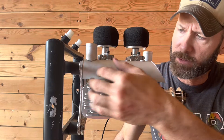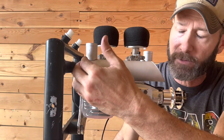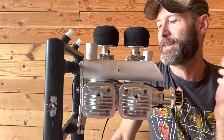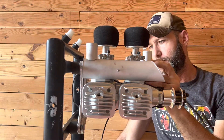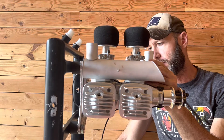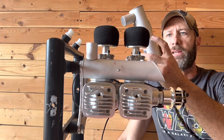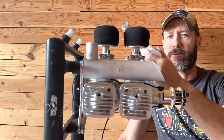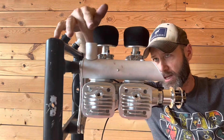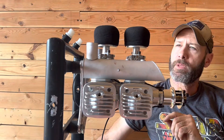This is a three-hole muffler. I had to put the original spacer that came with the DLE-222 back on to give enough room to get this muffler to fit. Had to do a little redneck engineering — there's a bolt you can't quite see there. This muffler does not go on this side permanently, but just to keep trash from getting down into the piston I'm putting it on for now without lock-tite. This is a four-hole and I've ordered another three-hole. I'm going to take off this vent and flip that three-hole around, which will place the exhaust on that side.